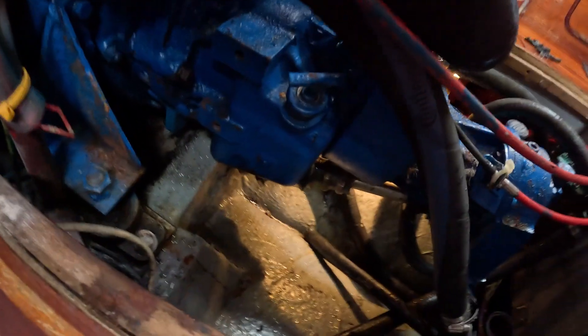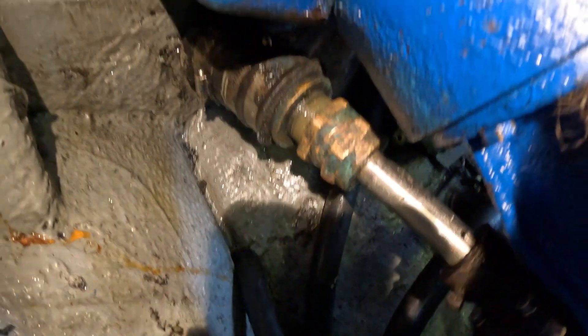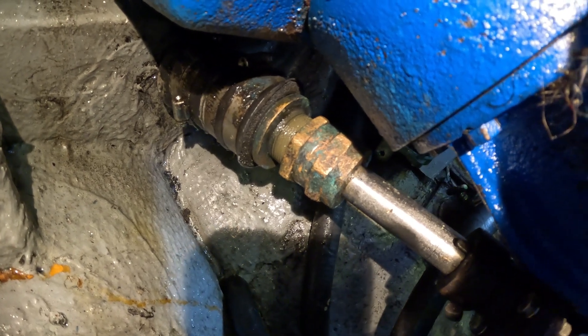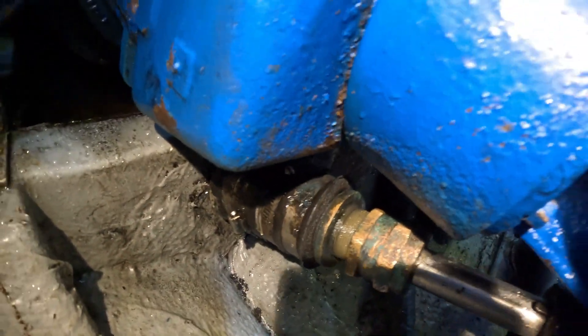Now that we're all sweaty and done — the owner's right here and he watched me do this whole process. We ended up getting two pieces of yarn in there. This right here is finished. We tightened up that little thin brass nut with two packings inside the big nut. But we were watching this and we both agree that it's always good to do routine maintenance on these stainless steel straps back here — actually one of them is rusted.